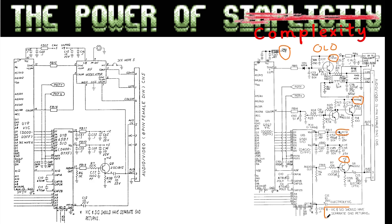An important notice regarding power supply design: the VIC and SID should have separate ground and VDD returns, and while that's not entirely possible on a C64, they should be connected to one common source, not directly to each other. The RF modulator is fed by unregulated 9 volt — just rectified and filtered. Everything connected here is also inside the newer kind of RF modulator, which also has the can plus 5 volt.